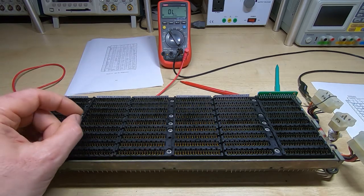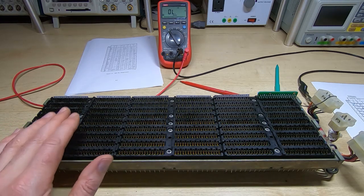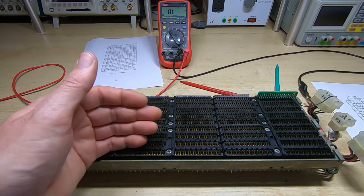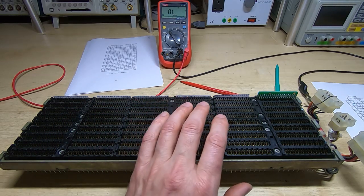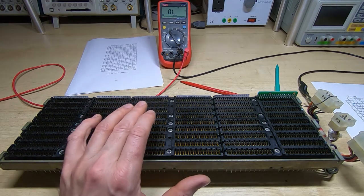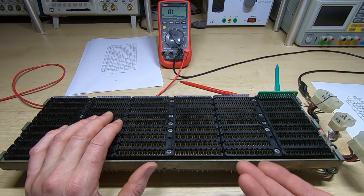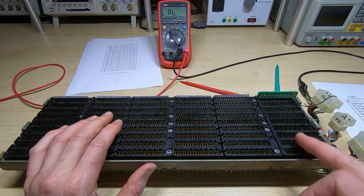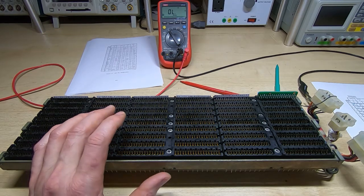Once I've been through the entire thing I then have to find a solution. In this case I'd deem it a short-term solution — it's not a proper fix, but I need to get this working so I can assess the boards more fully. If it's a wire-wrapped wire that's faulty it's fairly easy to change: take out the old one, disconnect one end, wind the new wire on, find the other end, identify it, take the wire off and rewrap it. It takes probably a minute to replace each wire. What's trickier are the solder connections, and that's why I'm deeming this to not be a long-term fix. I'll repair quite a few of this type of machine that has very similar wire wrap connections on the back, so soldering them can be a problem — especially on this board because there's a plastic sheet on the underside of the wire wrap wire.